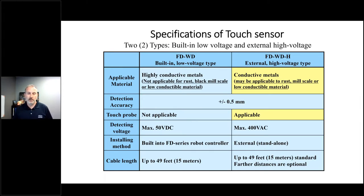If you're working on one of our slider robots that moves 12 to 40 meters on a track, your lead is going to be much longer — typically 1.5 times the length of your track. Both versions are built into our FD series robot controllers and have decent accuracy: plus or minus a half millimeter.